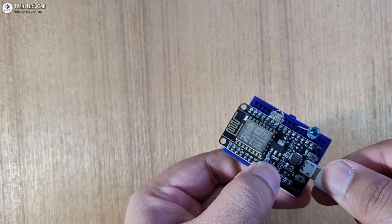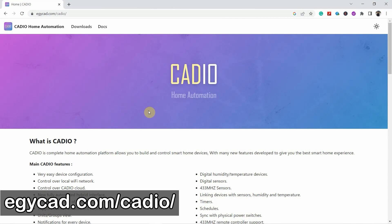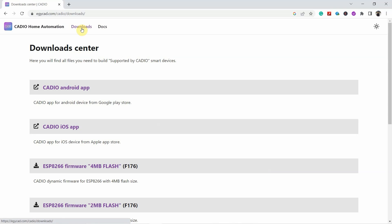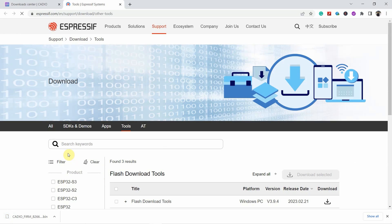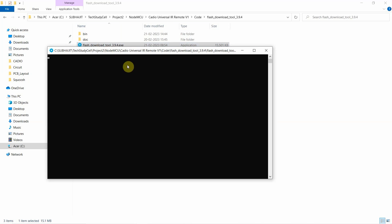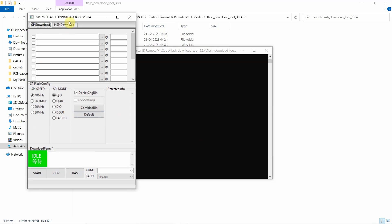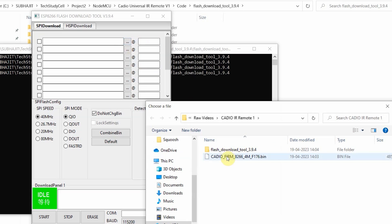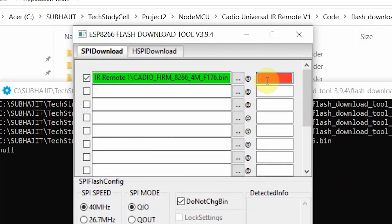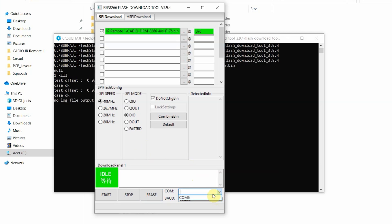Now let me connect the NodeMCU with my laptop to upload the firmware. To download the firmware for the ESP8266, you have to visit this page, then click on Downloads — I will share the website link in the description. This is the ESP8266 firmware; I will click here to download it. I also have to download the ESP download tool. I will quickly unzip this file, then open the downloaded tool. Click here to open the tool. In the chip type, I have selected ESP8266, then click OK. From here I have to browse the firmware file, then select it, and here I have to type the address 0x0. SPI speed will be 40 MHz and SPI mode will be DIO. Now I will select the proper COM port.